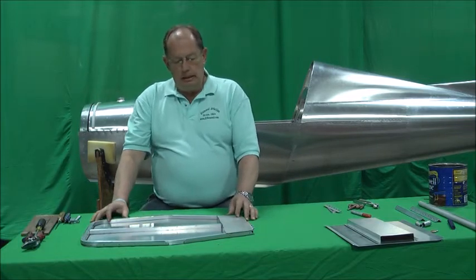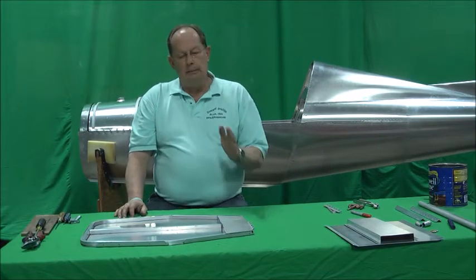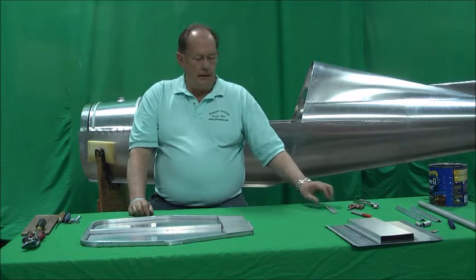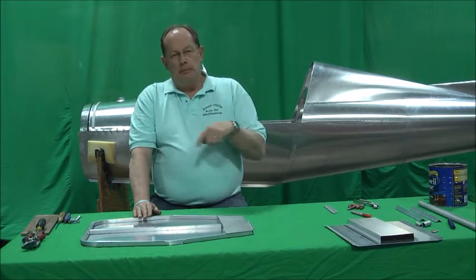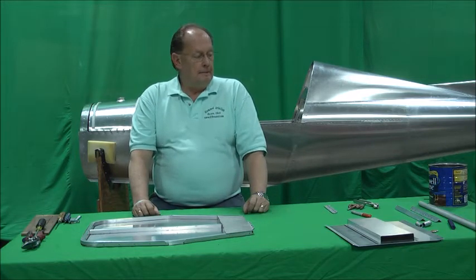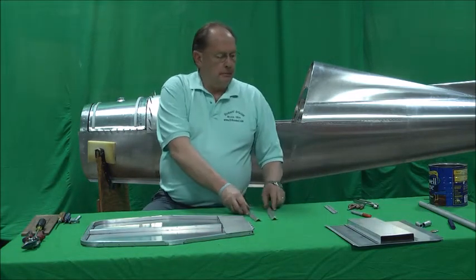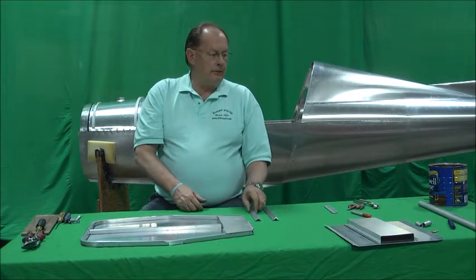The support, or the cross support, again that can be fixed. If you set it in there and get it fixed where you want it, you can take a piece of half-inch square tubing, put it across from side rail to side rail, put a couple of quarter gussets in like we did on the Ultra Cruiser ultralight airplane and make it fixed. But on the H5 your plans will show an adjustable pivot, adjustable backstop for the backrest.